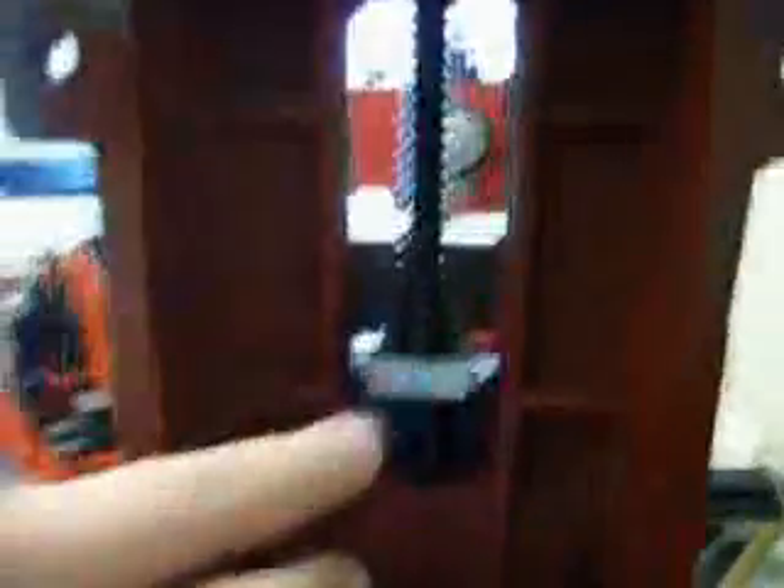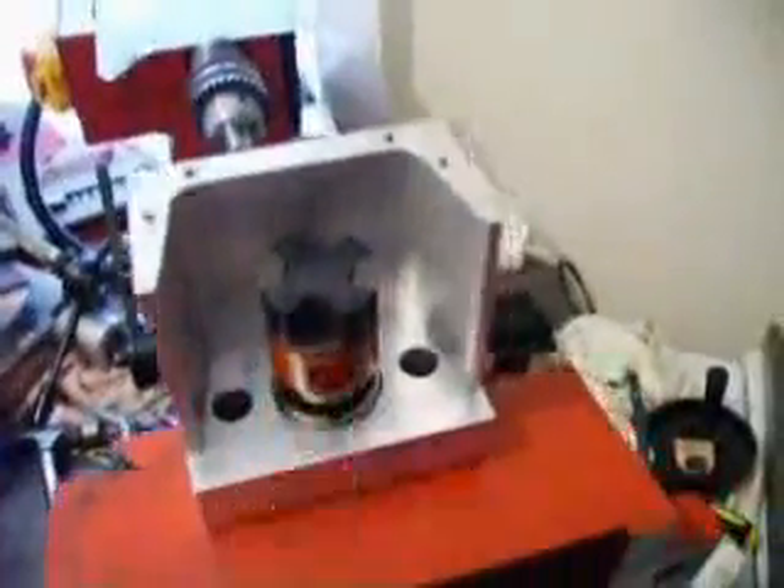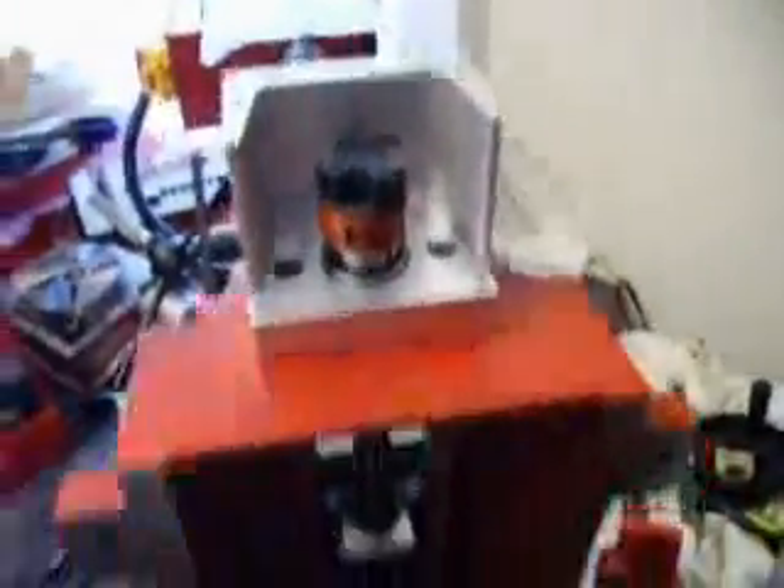I made sure that I got this lead screw right down the centre — as square as possible. I pushed it up into the hole and kept it held up into the hole as I tightened up the 5mm Allen screw. That seems to be OK, and I can turn the Lovejoy connector smoothly and wind it back and forwards.